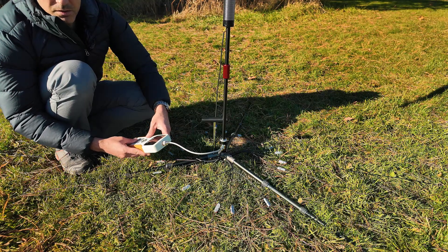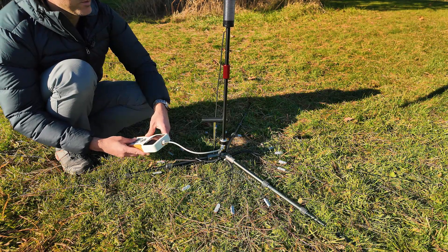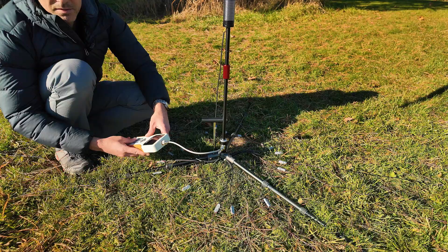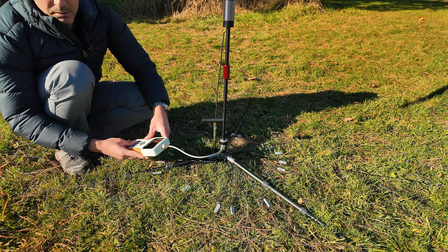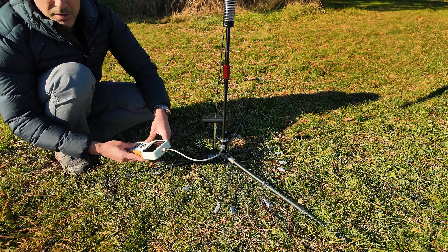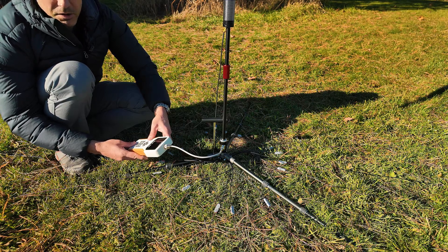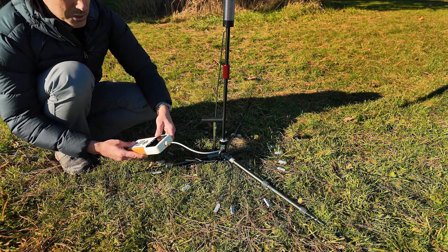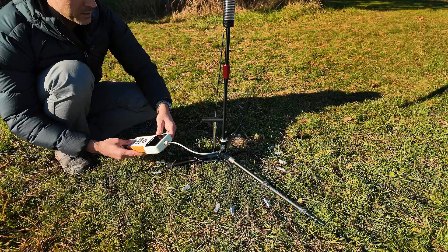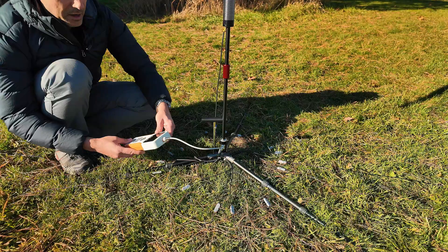This communication is much better during the winter time when thunderstorm activity is at its lowest, because it does create quite a bit of static. If you want to use it during daytime like we do today — close to noon — it's only good for ground wave and a single E-hop, which normally represents roughly about 15 miles of range that you can get out of it.